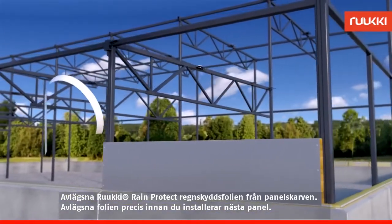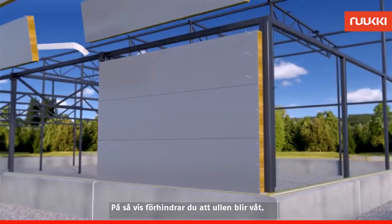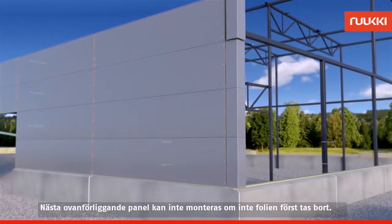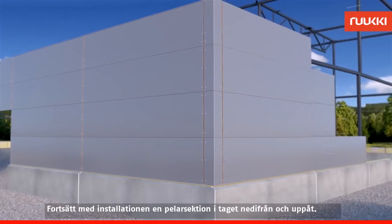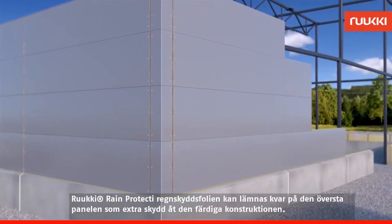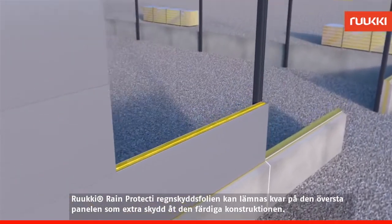Remove the film just before installing the next panel. This will prevent the wool from getting wet. Please note that the interlocking of panels is not possible if the film is not removed first. Continue the installation one pillar section at a time from bottom to top. The rain protection film can be left in place on the uppermost panel as extra protection for the completed structure.